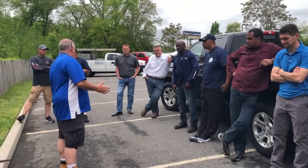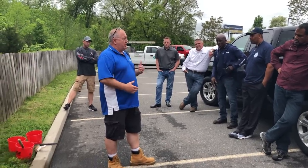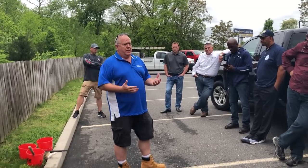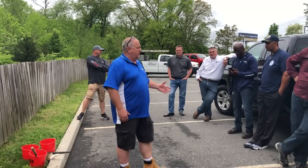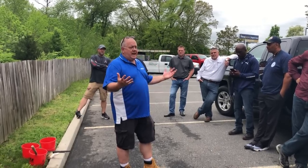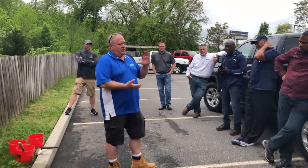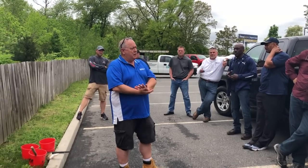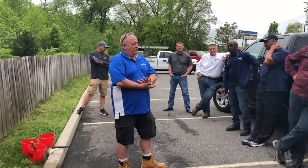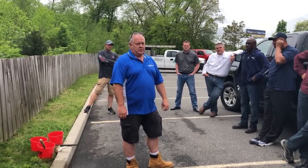We're always challenged in the Northeast, Pacific Northwest especially, and other places too, when we start getting the rain, the humidity, the heat, everything else. If you know that you can be a little more flexible with the product, you can. They mentioned not having oil as available. It's very hard to get anything oil-based in New Jersey. This makes it really easy. A water base will actually go into the wood, so it's working more like an oil. We sell it as it performs like an oil, because it goes into the wood, it doesn't sit on the surface. That's what we're trying to do with Deck Restoration Plus.